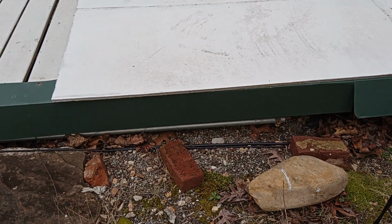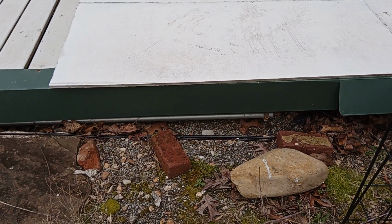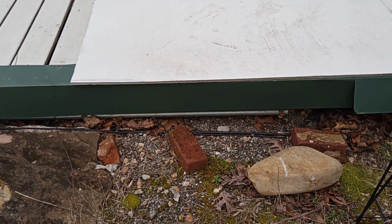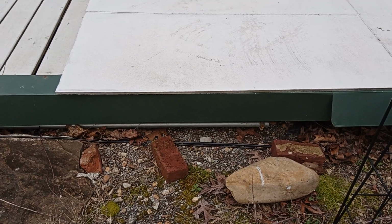I measured between the LMR 400 shield and the pipe. I measured about 70 picofarad per foot. So that implies 700 picofarad between the shield and the conduit. The conduit will act as, essentially, a big choke to the transient.